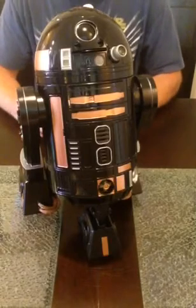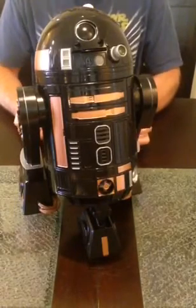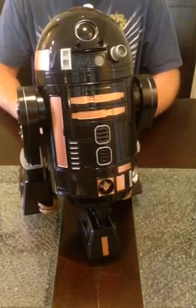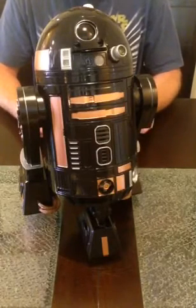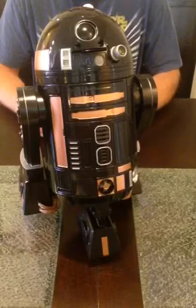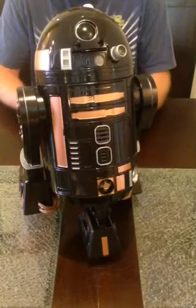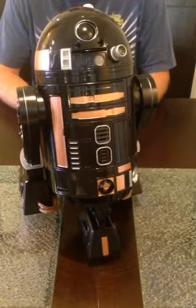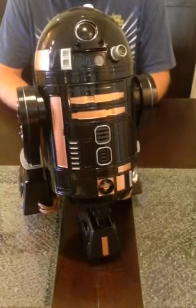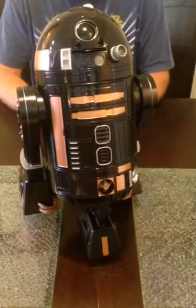The way we do this: once all the parts are stripped to raw plastic, we have a sand tumbler. We put each individual part into the sand tumbler and tumble them until the extremely smooth and shiny plastic surfaces are all roughed up. That's the only way we can get the paint to completely adhere. After the inside and outside surfaces were roughed up, we laid on three nice thick coats of Rust-Oleum black — an indoor-outdoor paint that is flexible, UV resistant, and the most durable paint we could find from a spray system for this droid.